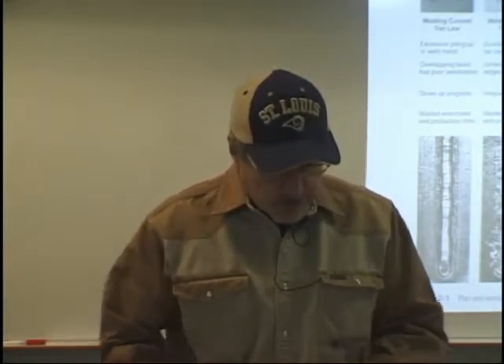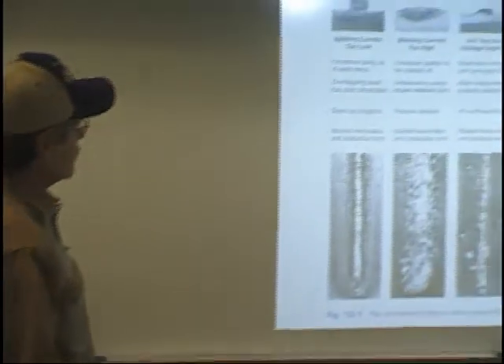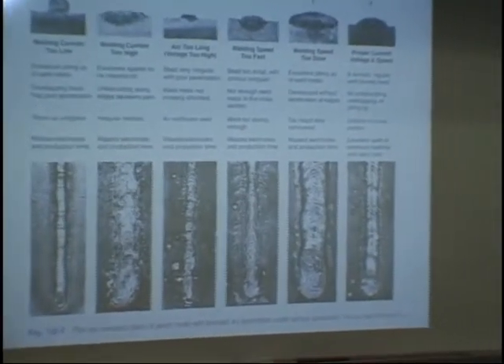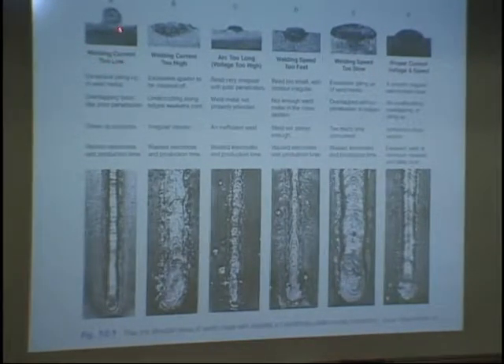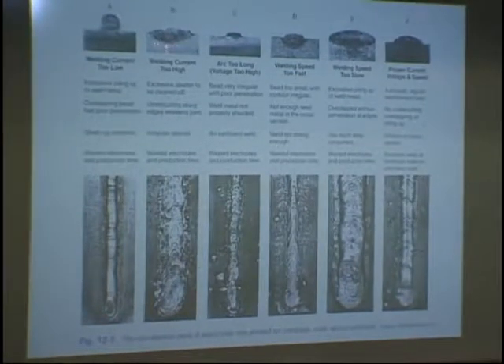We're going to pick up where it says introduction to covered electrodes. If you look at figure 12-1, I've got it up here on the board. This page illustrates what we're talking about. If you look at A, welding current too low — you can see how high and crowned this is, giving you a thin narrow bead. This one is very common — you see how broad and spread out it is with shallow penetration. That's when you're running it too hot. You can tell by how volatile and energetic the puddle is and the amount of spatter along the edges.